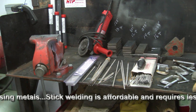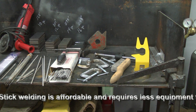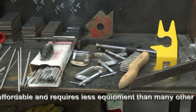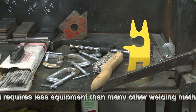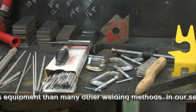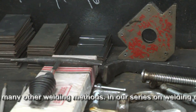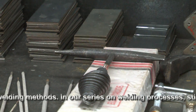The supplies and tools used for stick welding are minimal. In fact, this is one of the most cost-effective methods of welding. You do need a wire brush and clamps — clamps can run a range of costs. On the wire brush, if you're working with stainless steel, make sure that the brush is stainless; otherwise the typical welding brush is sufficient. You'll need a slag hammer — this is a chipping hammer. One end is like a chiseled point, the other is sharp, and you need this to knock slag off of your welds.